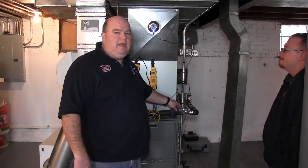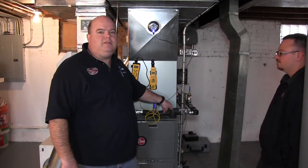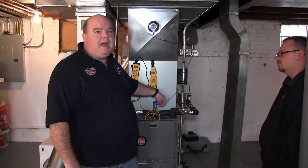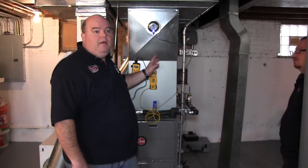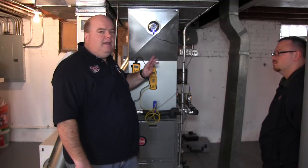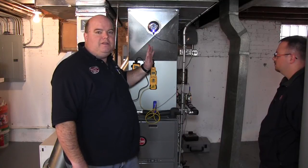The key to this system is sizing it so that the return water temperature ends up being below 105 degrees - 107 degrees is the magic number on the return water. So if you've got this set at 125 and it bleeds off 30 degrees, that means it's going to be 95-degree water going back into the tankless hot water heater. The key is that it's a condensing hot water heater. If the water returning is above 107 degrees, it's not going to condense. It'll heat your house and water fine, but basically it drops to just an 80 to 86% efficient hot water tank.